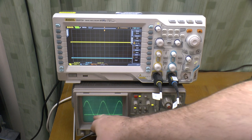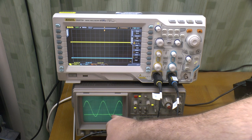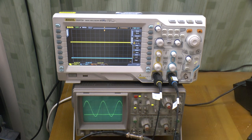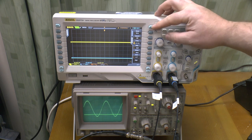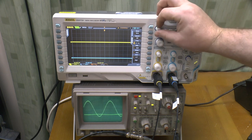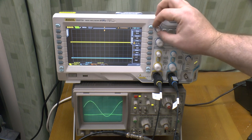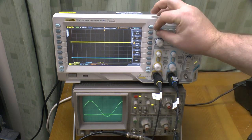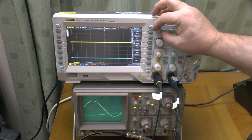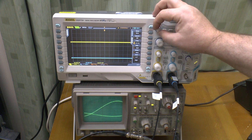And you can see at 50 hertz, there's a little bit of response from the low pass filter, but very little. Let's dial it down. We're down to 30 hertz, 25, you can see it's starting to pull a bit now, but still no response from the alarm. Now you can see we're coming down to 10 hertz. There's much more pull from this.